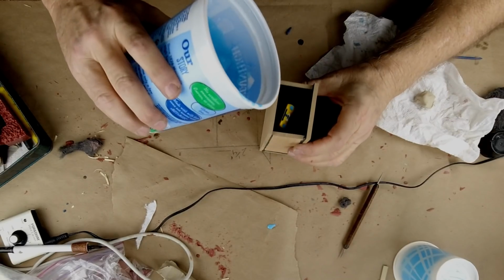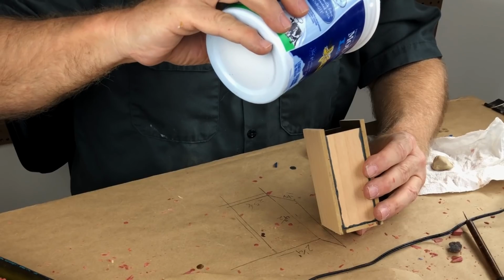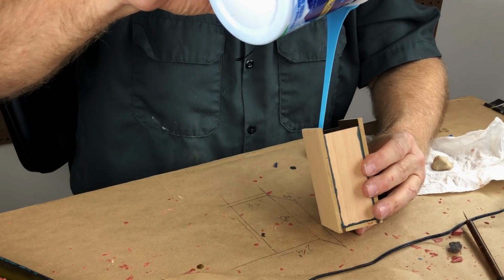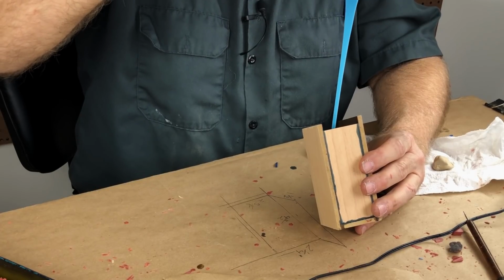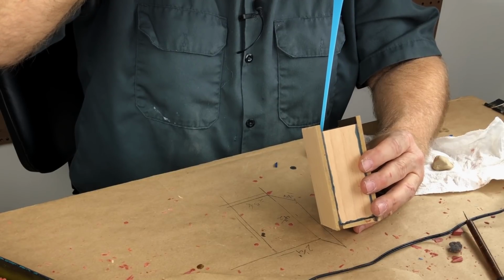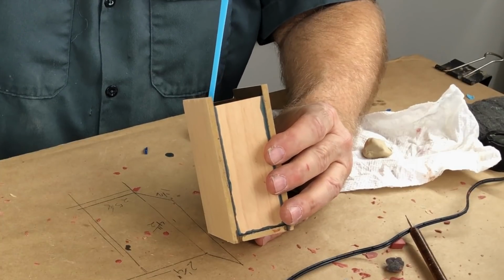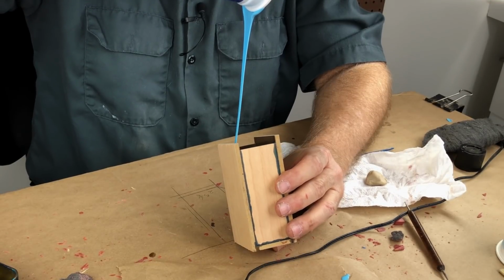What I'm gonna do is start in, pour into the corner, but I want to pour at an angle, so I'm running down the side. I'm going to run right down this corner to the bottom. I left enough room down this side that the rubber flows straight to the bottom of the mold, and it should be rising very nicely in there. No problems at all. Just keep pouring it. Fast, fast, fast. But it's just filling just beautifully.